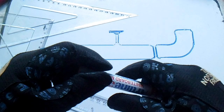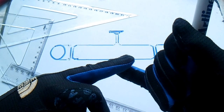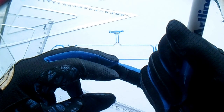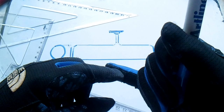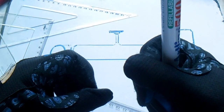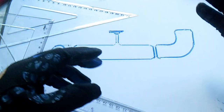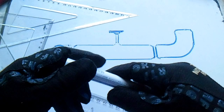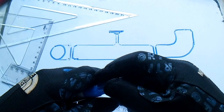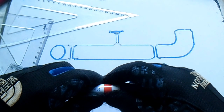First, check your drawing — check your revision drawing to confirm it is the latest revision. This is very important. If you are holding an old revision drawing, finish the fit-up, and then a new latest drawing comes out, your job is useless — you have to cut it out and make the fit-up again. So it is very important to check the latest revision drawing.